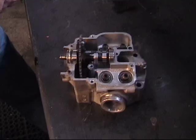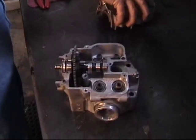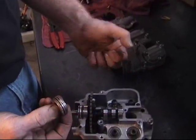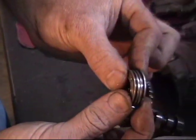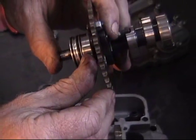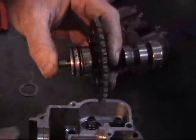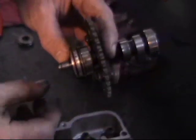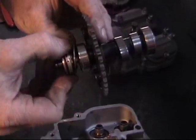That's pretty much all there is to changing a water pump seal. If you're doing a 2000-2001, you have to remove the valve cover to remove the carrier because it's all one piece. The newer carriers are two piece: you have the carrier and a backing ring. The backing ring fits in the groove and keeps it from coming out, which is a nice upgrade. This is how it should look: backing ring, then your O-ring, then your weep hole. If either seal leaks, it runs out the weep hole at the bottom. On the newer models, when you pull the carrier off, the backing ring stays in place and just the seals come out.